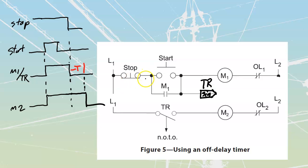And I'm going to have as well underneath here, in parallel with this, a constantly powered timing relay. It's going to look like that. So the timing relay coil itself in an electronic timing relay stays powered on at all times. It is the signal input that acts like the old school timing relays, the one that's going to monitor. So if I were to follow my operation with a modern electronic one, I'd press my start, I'd energize M1, and at the same time I would be providing signal into my timing relay, which would then start that thing up.